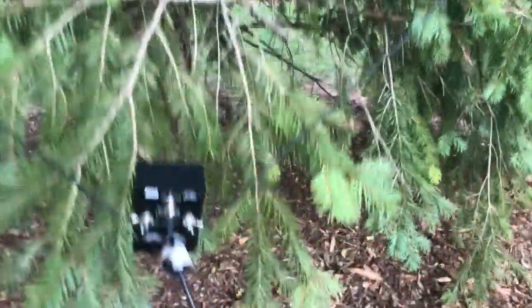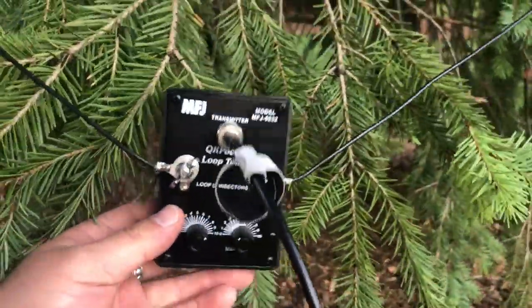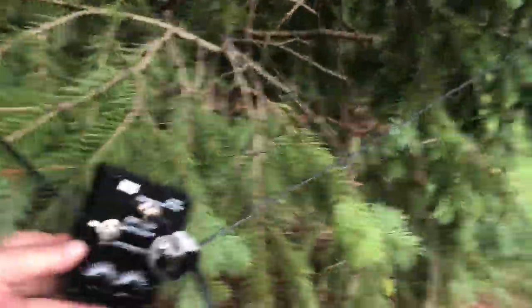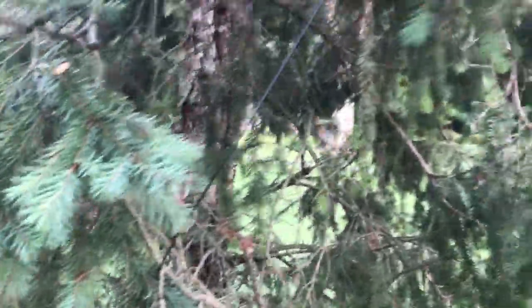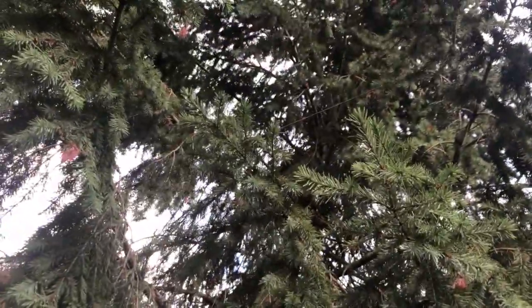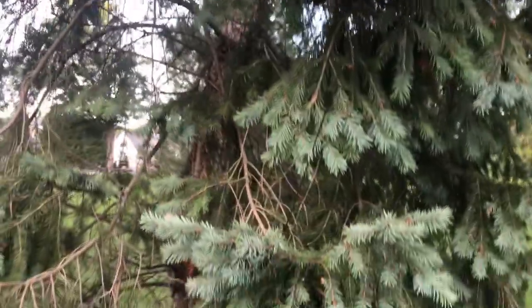Here's the box — it's got a BNC connector. I just took one wire, hooked it up, threw the box into the tree and caught it. So the wire is going up into the branches — everything that we would think would not work because the tree is going to absorb some of the RF. It goes up there — you can't really see it. It's probably about 10 feet up at the top, just making all kinds of not-a-loop shape, then going back down.